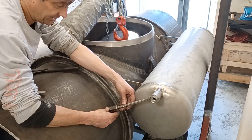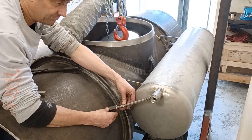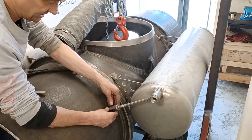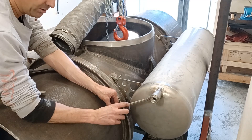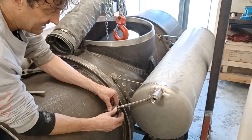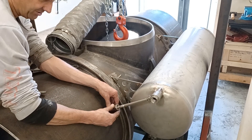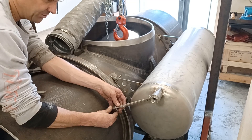This is 32 degrees I think, but I'm just going to do it so that it's in the right place. I'm also going to put a universal joint in here to take up any minor discrepancy, so it doesn't really matter if this is not super accurate — but I want it as near as I can get it of course.